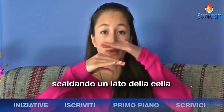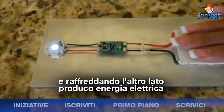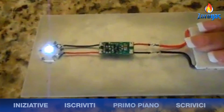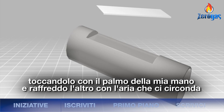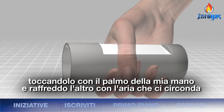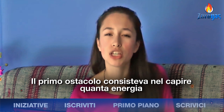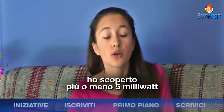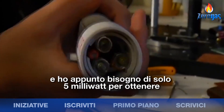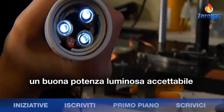If this is the tile and you heat one side of the tile and you cool the other, electricity is produced. In my case, I'd be heating one side of the tile with the palm of my hand and cooling the other with just the ambient air. My first step was finding how much heat per centimeter squared our body radiates. I found this to be around 5 milliwatts, and I needed only 0.5 milliwatts to obtain a good usable LED brightness.